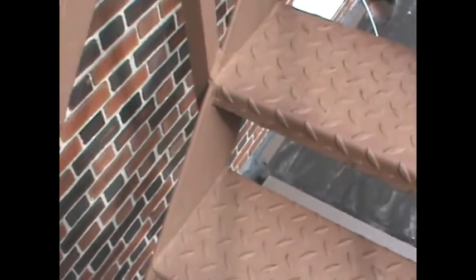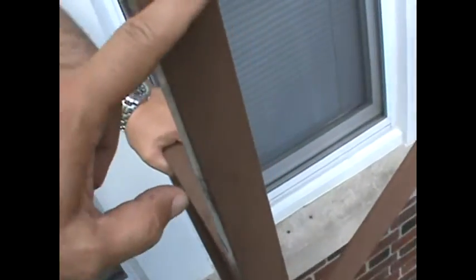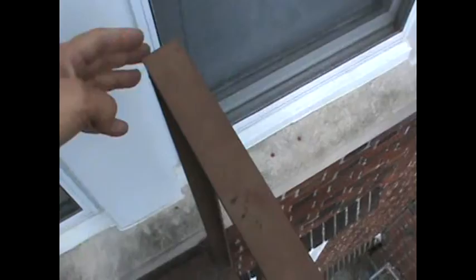All my treads, 100% of my treads, need a clip underneath with two or three bolts on either side. This is welded down here. I put a clip, bolt, no load test. All these joints that are welded, as soon as I make a mechanical fastener, no load test or x-ray needed. So we can proceed on this Firescape to a load test, or we can eliminate the load test by negating the issue with the welds.